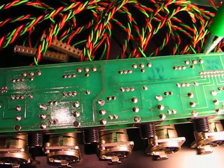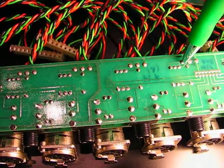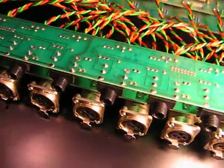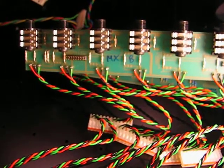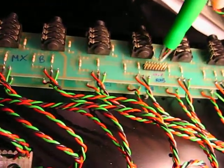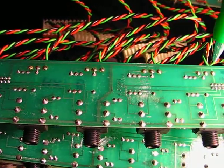The only wrinkle to that would be if I ever wanted to put these multi-pin connectors in — I can't imagine that I would — but those have to tie in; it would mean running a jumper wire from up top back here. And then we've got the insert jack PCB — it's the same printed circuit board, just some differences in the zero ohm jumpers because this is an unbalanced insert tip-ring-shield standard. Notice that those multi-pin connectors are in place on this one, although not used on this mixer.